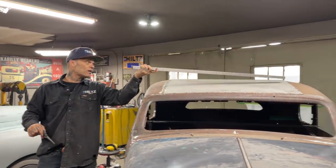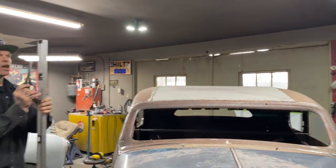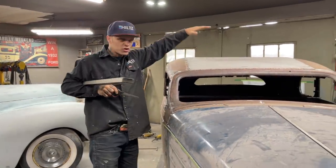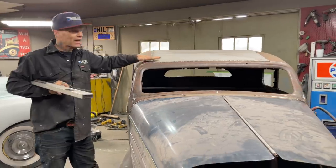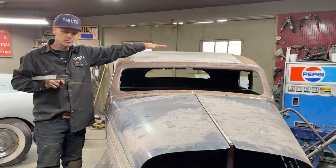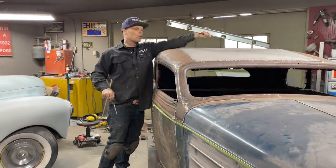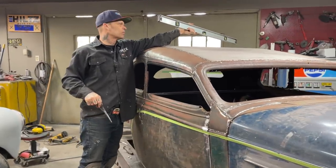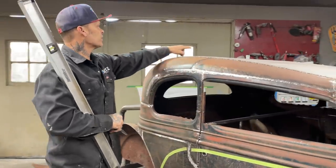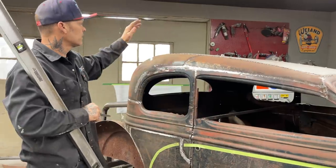On this side over here, like I said, I'm going to undo it, and I'm going to go on the inside, push up on the metal a little bit, and then do it again. If you can remember, I was pushing down on that quite hard to get that to go down, so all the weight was going down on that, and we might have pushed it down. We did push it down a little too far. I even cut it on this side. I even cut it on that corner. Remember, we laid it down on that side, put it down a little bit. And we're just going to have to undo it. And it's no big deal because it's not welded. It's just self-tappers over there. Undo it. On the inside, push up a little bit and reconnect it.